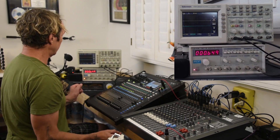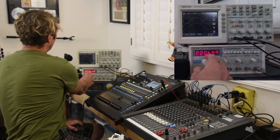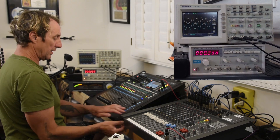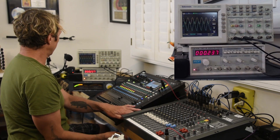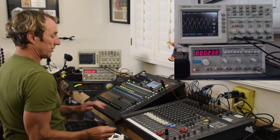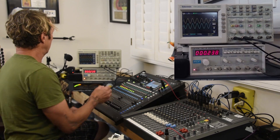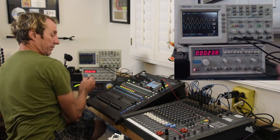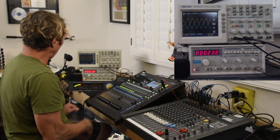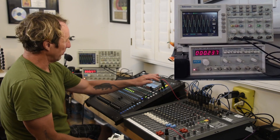Let's try a different frequency and see how that changes things. We were at 650 Hz — let's try 300 Hz. Here's 300 Hz on the analog and 300 Hz on the digital. Let's find where the digital is starting to distort. The digital console right now looks very clean and none of the peak lights are lit — we're at plus twelve, not a single red light.